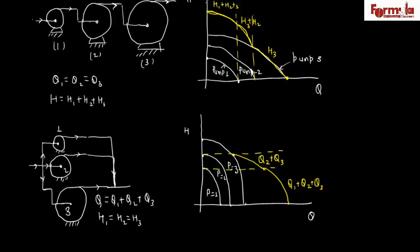After this point, we have to shut off pump one and bypass it, because it cannot deliver head beyond that limit. There is a loss of discharge here, and the curve follows a new path where the available discharge equals Q2 + Q3. After the next limit point, pump two must also be shut off and bypassed. Beyond that region, only pump three operates, providing only Q3.